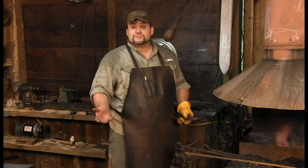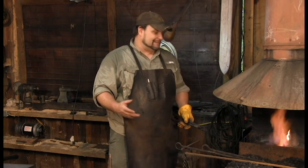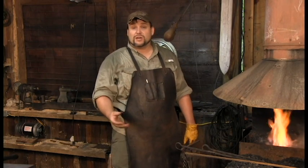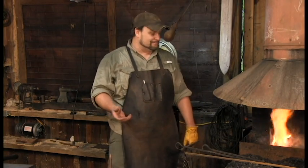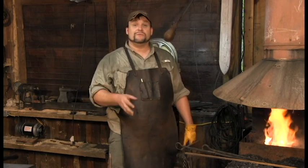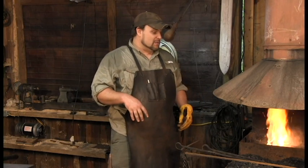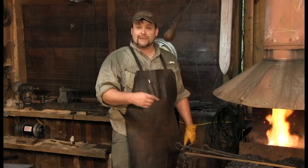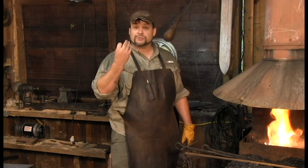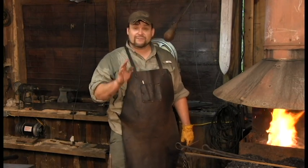The second verse is pretty much the same as the first — we're going to take a heat, draw that taper, and round it. Now if you're a blacksmith and you're worth your salt and you've done a lot of these, you should be able to do them lightning fast in the shop. What pretty much took us three heats to do the first time — to do the taper, round it off, and bend it into a hook — we're going to do in one heat. We're going to go to the face of the anvil, knock the edges off, then go to the horn of the anvil, and hopefully before I run out of heat, I'll have the second portion of this hook completely ready to go in one heat.